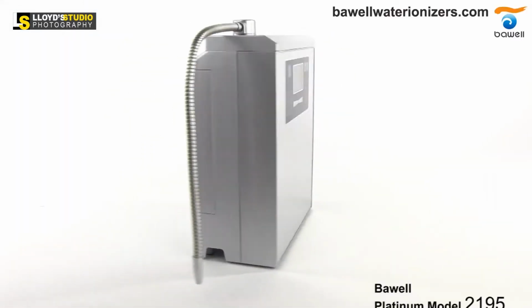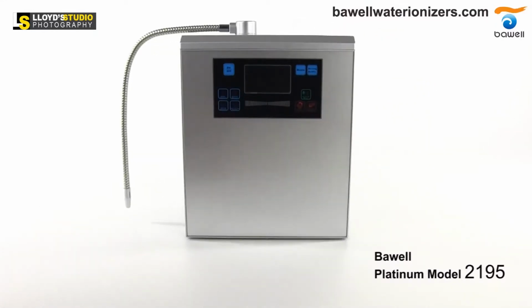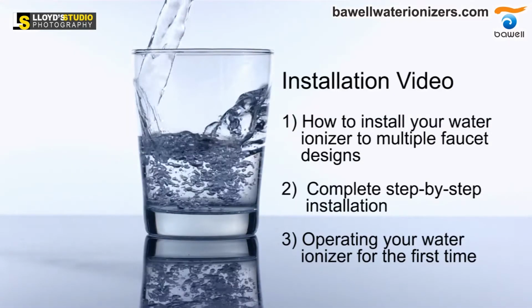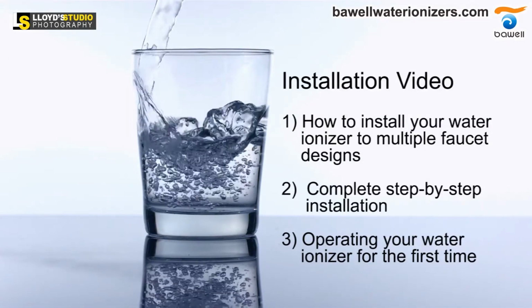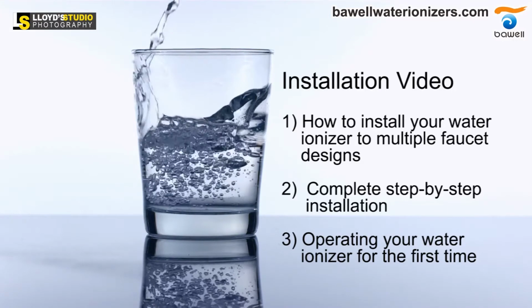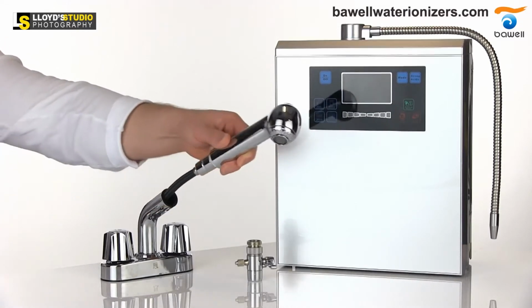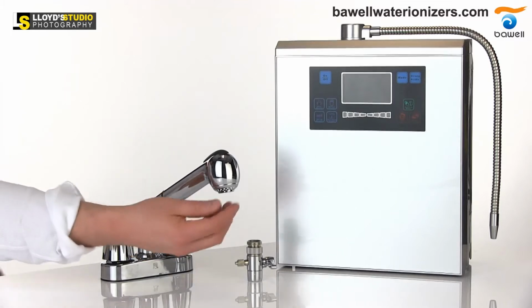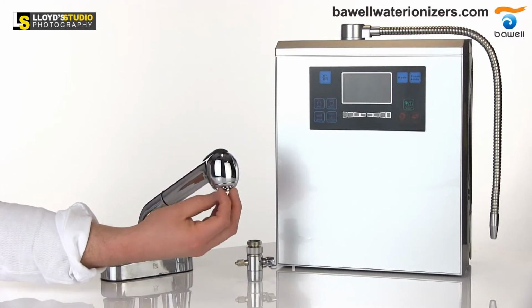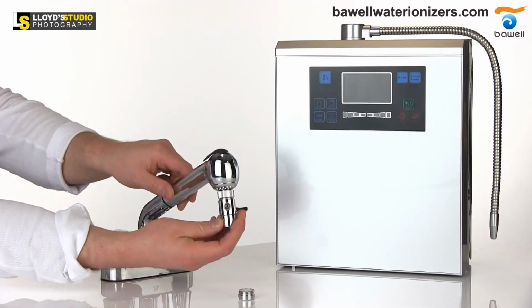This video will demonstrate the proper installation procedures of the Bawell Water Ionizer. First, unscrew the aerator. Then screw in the adapter to your faucet type.